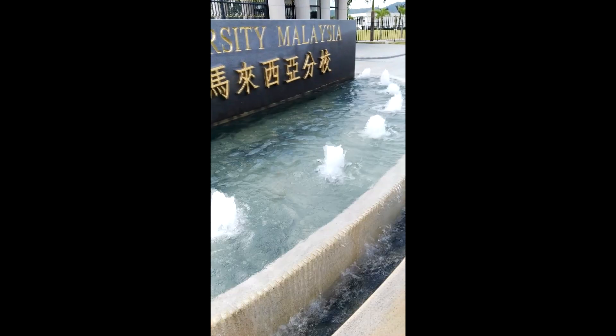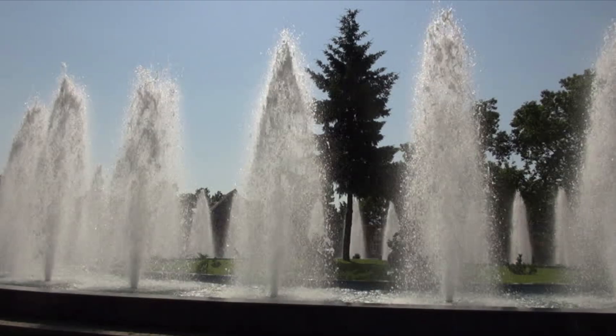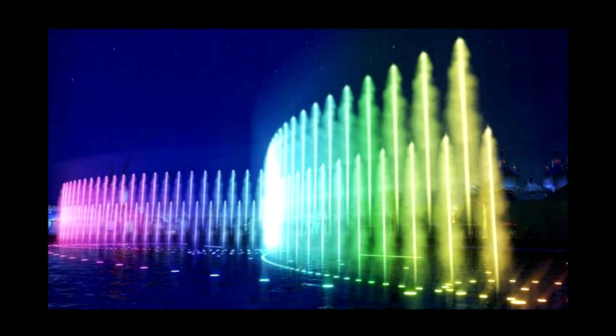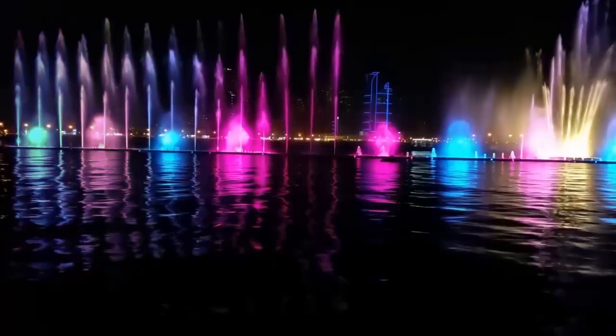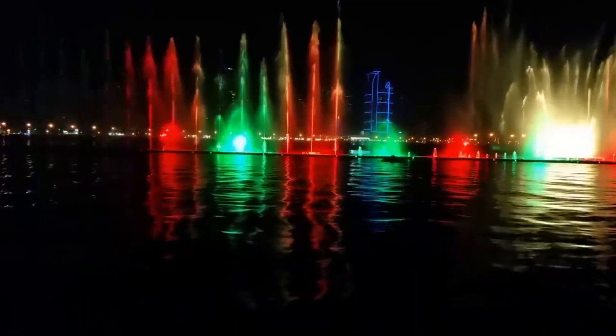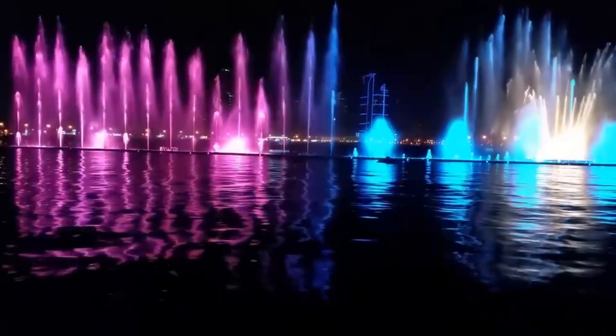In a nutshell, Bernoulli's equation helps us understand that changes in pressure and area will certainly affect the height of the water level in a fountain. However, in real-life applications, atmospheric pressure alone will not give a desired water level for an astonishing view. To achieve a higher water level, we use a pump instead. A simple pump such as a centrifugal pump can deliver a high water level. Musical water fountains actually use the theory of Bernoulli's equation — different nozzle areas give different types of water flow rate, and with a combination of different pumps, beautiful patterns of splashing water can be achieved.